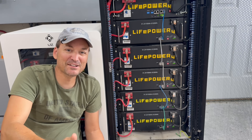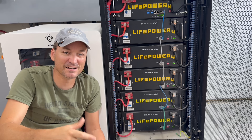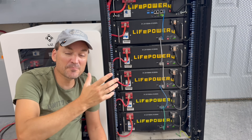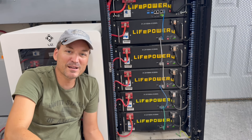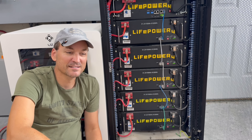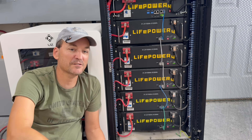Since I don't charge with the grid in the winter, when I know there's going to be plenty of sun and I've had a drift after three, four, five, or six days of barely getting any charge, I'll set everything to voltage mode and charge the pack back up that way. Hopefully this video also helped for those with a parasitic load issue. These batteries are meant to be cycled — constantly used up and down, which is actually the healthiest thing for lithium iron phosphate. So figure out a way to use your batteries under a load. A lot of people set these up for UPS backup, but it's best to keep them at least cycled a little bit. There's nothing wrong with a UPS setup in a basement or garage, but if you can create a critical loads panel to run freezers, that would help cycle the batteries.